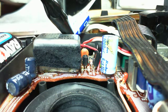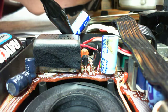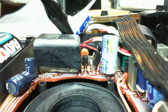Let's read the voltage on this. Well, I'll be. I just pulled out the power supply plug. The radio continued working. Of course, the batteries are in. Okay, this is supposedly bringing in 8 volts. Almost 9 volts on this thing. Let me turn it back down because that's a little uncomfortably high. Okay, so now my little external power supply is set to 4.5 and it's actually producing 7 volts.